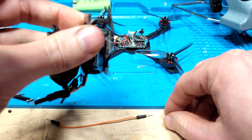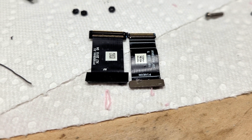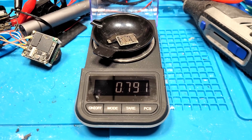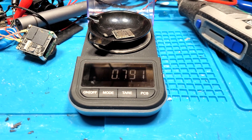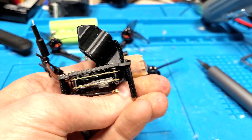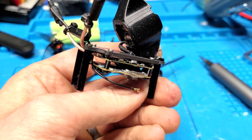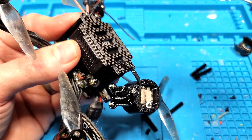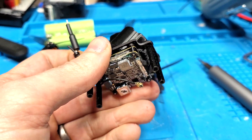The low cost of whip antennas is an added bonus. Mounting the naked O3 was a bit of a challenge, mostly because the O3 connector cable is longer than on the Vista, and the minimum comfortable distance was 5mm spacers. I trimmed the SD card module down to less than a gram, but decided to just use the onboard storage and offload files to my phone or tablet in the field. Stack screws are held secure by metal nuts, which provided perfect spacing to hold the antenna connectors in place. The stack height can be increased with longer standoffs, meaning a stock O3 air unit can be easily mounted with just four screws if desired. I also replaced the stock camera cable with a much smaller 6mm variant to clean up the build and save even more weight.